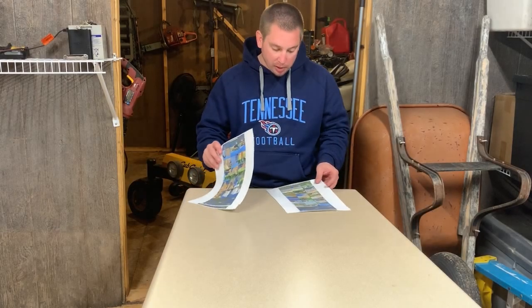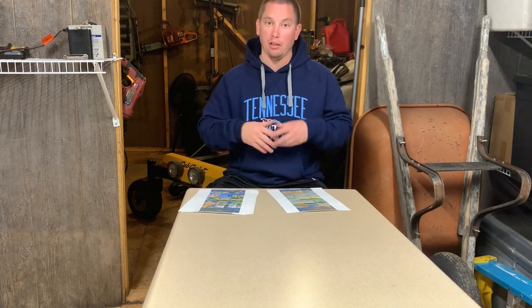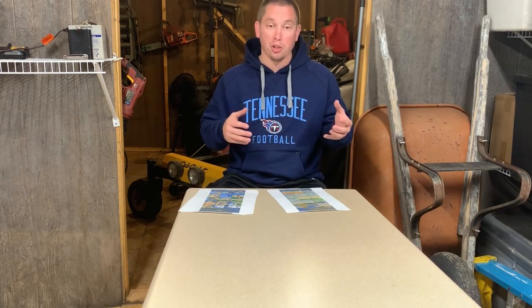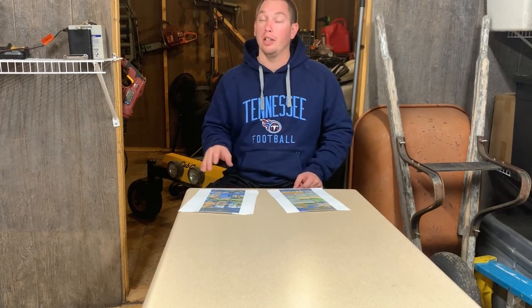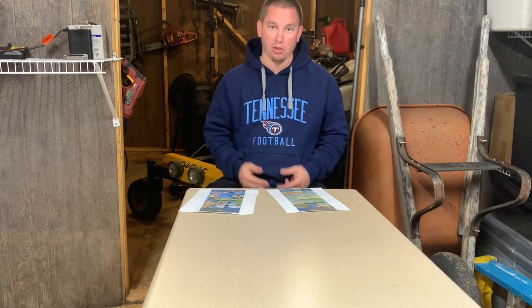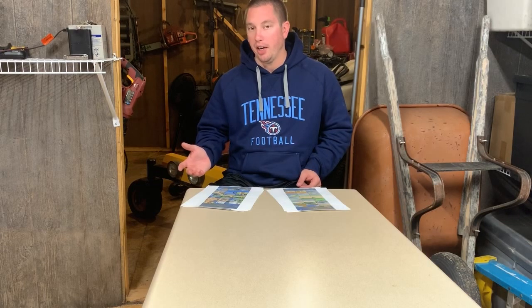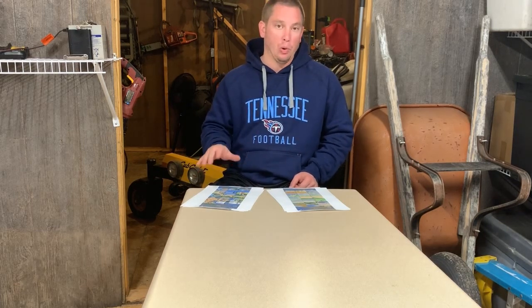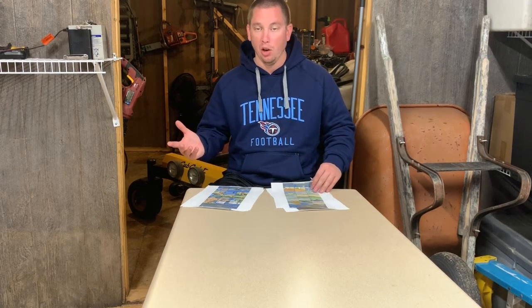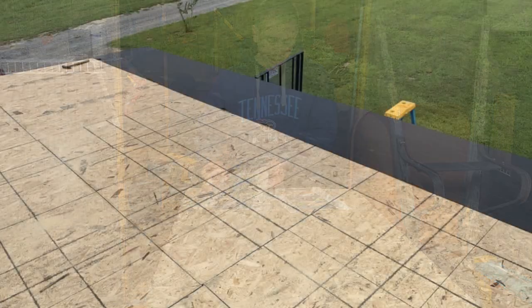Once I got all the plywood done, I started moving on to the shingles. I got all the same shingles over this whole entire roof. For just me with a hammer and roofing nails it took a long time, but I did it. I got the same shingles over the shed and over the overhang so it's one big roof. I also put roofing felt rolled over the whole thing before I put my shingles on — it's just a water barrier. So I got my roofing felt on and then all of my shingles installed.